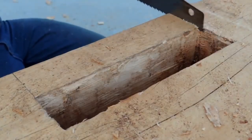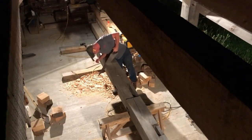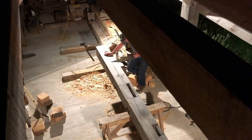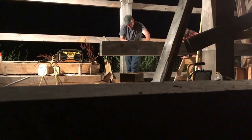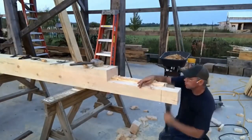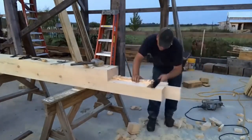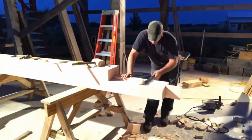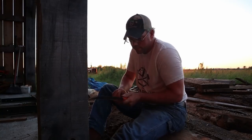Hand saws — another super important tool, because if you're going to build something you need to be able to cut. Keep in mind you can throw this entire tool list in your day pack if you had to. It's not fast, but it will get you where you need to be. Hand saws can be found dirt cheap — three to ten dollars at a flea market, just needing rust cleaned off and teeth sharpened and set. You should really have two: a crosscut saw and a ripping saw. The teeth are totally different and meant for different jobs. You can even get one at Harbor Freight and it'll do you just fine.